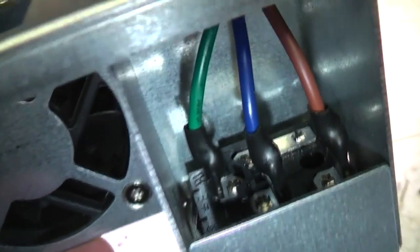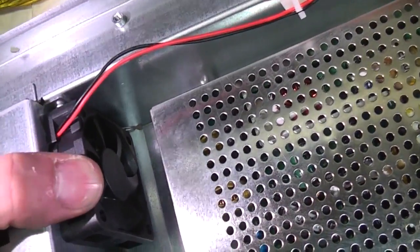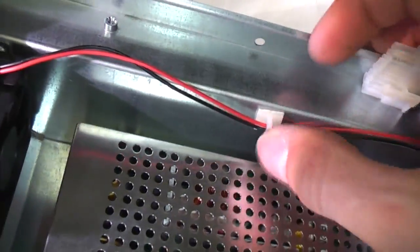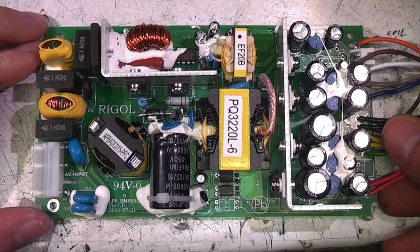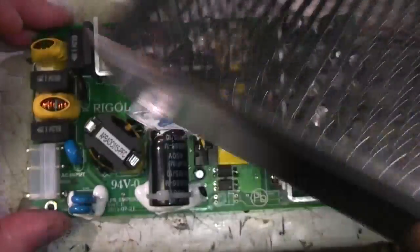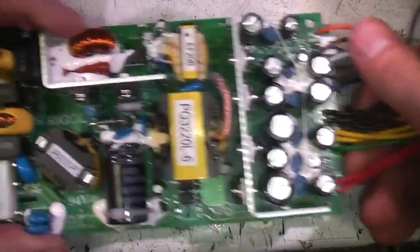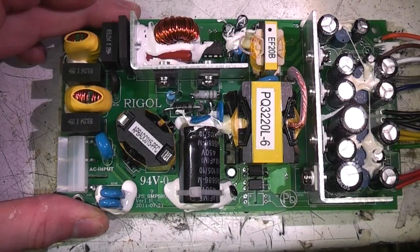Let's take a look at the back of the unit and the power supply. The mains comes in on an IEC socket, the connections are fairly well protected and also heat-shrunk. The fan's in there — I'm not really sure it actually gets warm enough to need the fan; I had it running for a few hours and couldn't detect any warmth at all. There's a stick-down cable clip which can fall off over time, but the cable's not going to do any damage. The power supply looks pretty nice — it's got Rigol on it so maybe it is actually made by them rather than bought in. It's a board with a separate cover. Proper fibreglass PCB, with resin on it for holding heavy components — common practice.